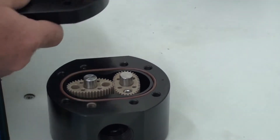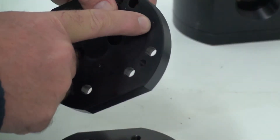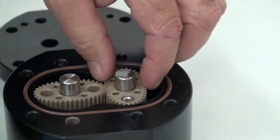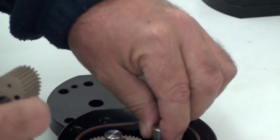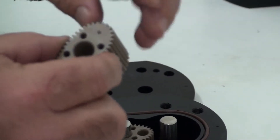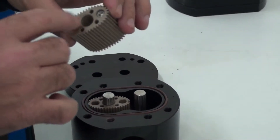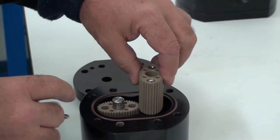On the new MX range we have what's called a dimple — there's a little dimple at the top of the housing. This signifies where the active rotor sits. The active rotor has a dimple on its top, and those three dimples must go together when we reassemble. The active rotor has magnets in it and goes with the magnets down.